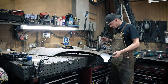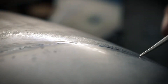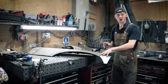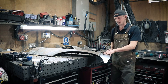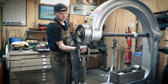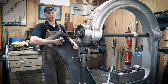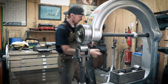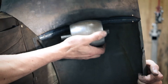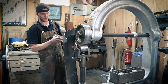I've used the hammer and dolly and I'm fairly happy with how it's come out — I managed to flatten off the weld quite well and I've got the right shape to the panel, but it's not quite good enough. So I'm going to send it through the English wheel for a couple of passes just to iron it out and smooth it right out. The first wheel I'm using is slightly flatter so I can wheel the panel along the weld, and I'll use a second wheel which has more curve in it so I can go across the weld — that way I'll get two passes on it and hopefully smooth it right out.